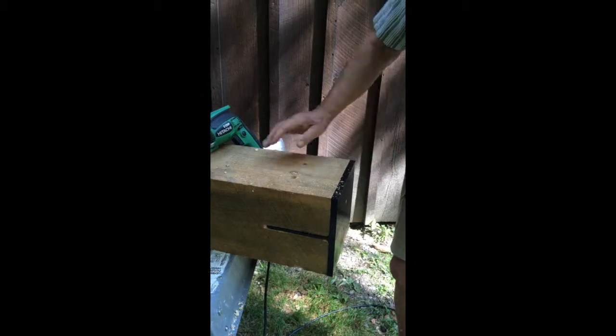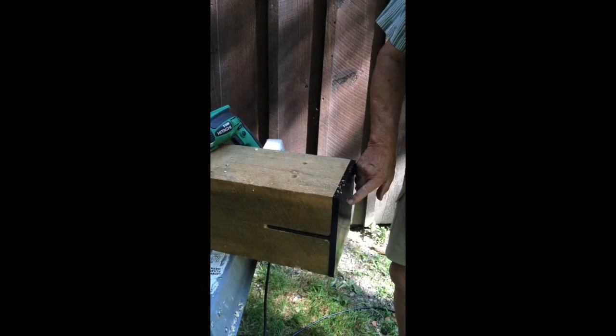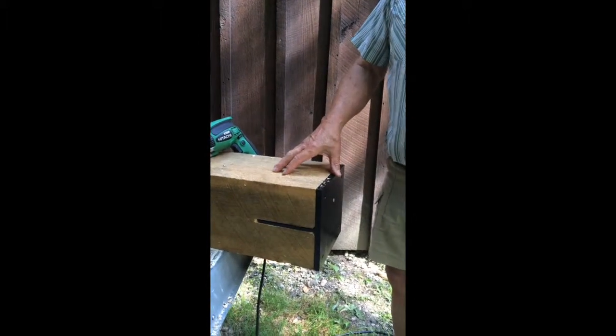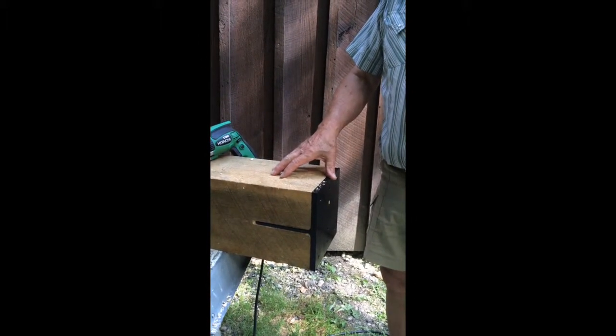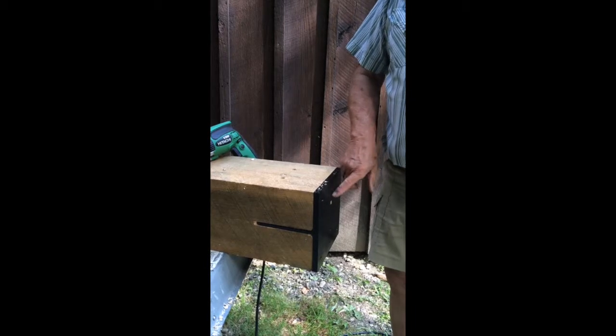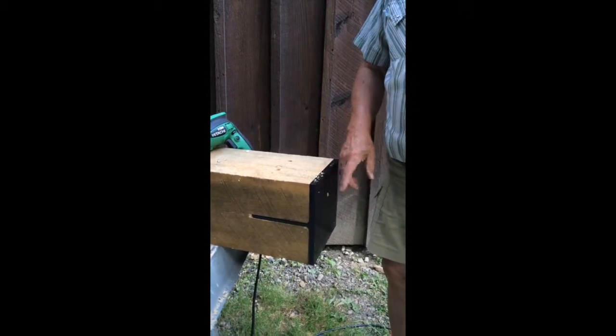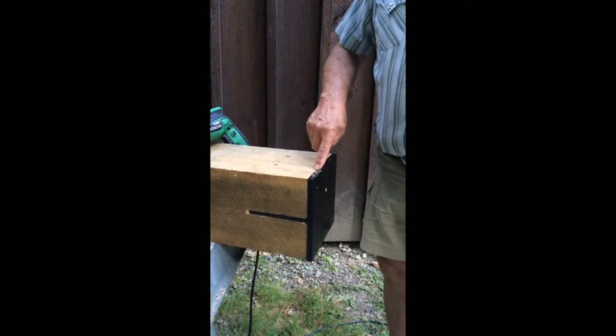This is done — it's ready for assembly into the frame. This connector stays on this beam. If we were doing a kit, these would ride together until they got to the job site, and you'd screw this connector either to a plate or to a vertical post, and this beam would stay with this connector.